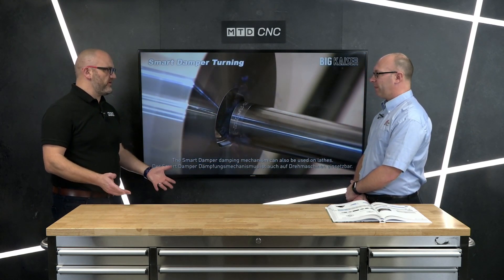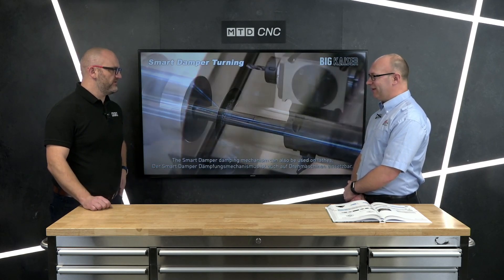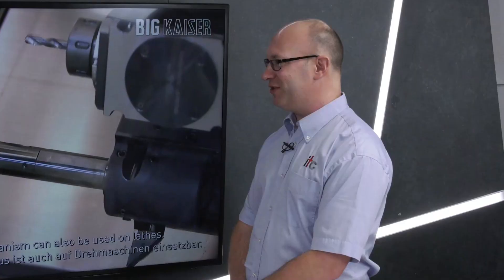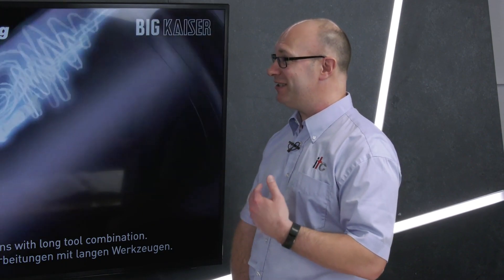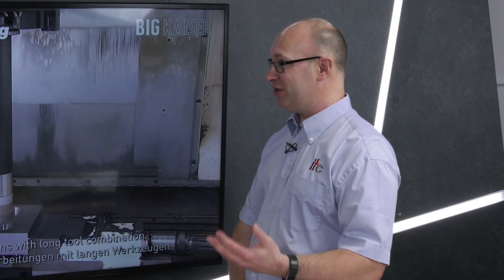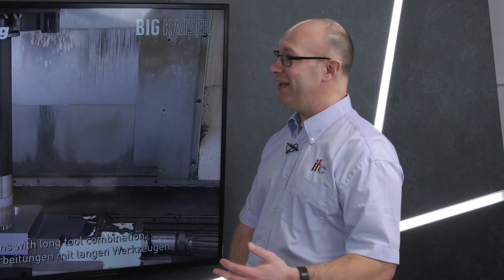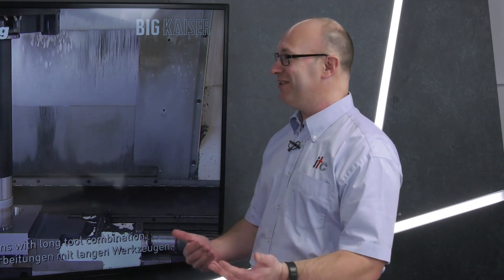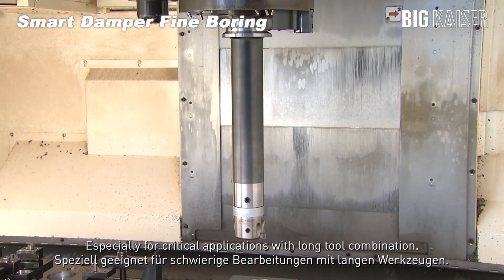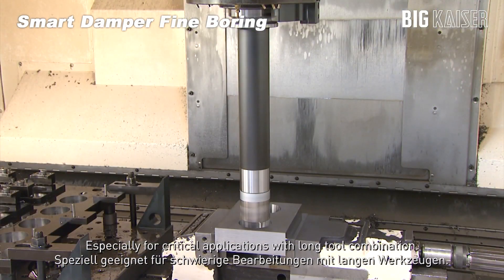Chatter and harmonics vibration is your biggest tool life killer. Yesterday was fun but we were trying to use a finishing insert — a WS10 grade. As soon as it chatters, it takes the edge off the insert. So you go to a more medium geometry of a tougher grade — it's fine when it's not chattering, but if it starts to cut properly it then wears quicker. You're just chasing yourself all the time. If you can take the chatter out of it, it solves a big problem straight away.